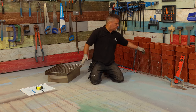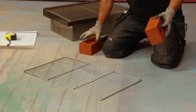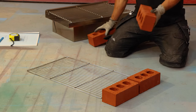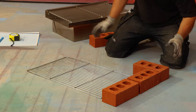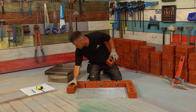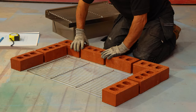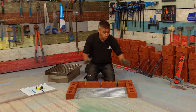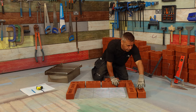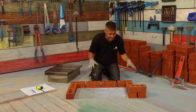Part of your kit you'll get these grills. These are designed for use with different types of bricks, whether they are imperial size bricks or metric size bricks. I'm using Forterra's engineering red bricks which are a metric size, and I'm just going to do a dry run by spotting these on this griddle. Some manufacturers that make barbecue kits say that you can build it with a single skin, which is fine, but I always prefer a double skin because it's going to be a lot stronger. That would mean creating another course all the way around, and then your second brick will bridge across it and tie all the bricks.